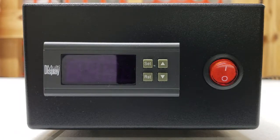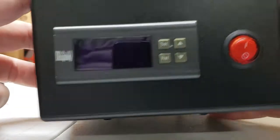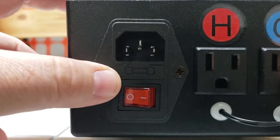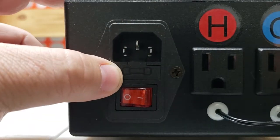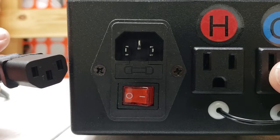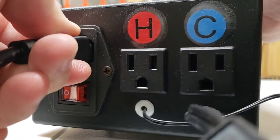I'm going to go over a few things, mainly some issues — resetting the unit, doing a factory reset. So on this unit, with the new model that has the sliding lock that locks into the top plate of the incubator, if you flip the controller around you're going to see a fuse here that you can pop out once the cord isn't in there with a little flathead screwdriver, and we include a replacement fuse. You've got a cord that you'll find if you purchase the incubator or just a controller by itself — it looks like this with the new model — and you just want to line that up and plug that in.